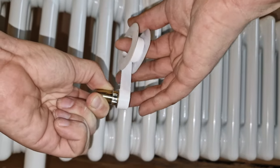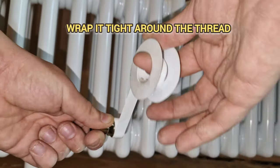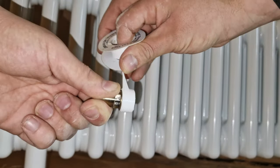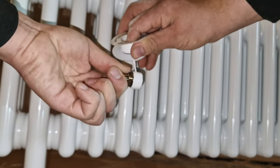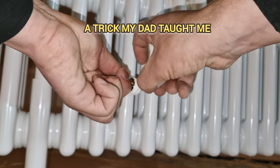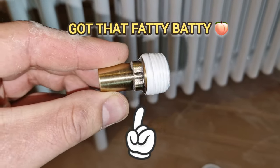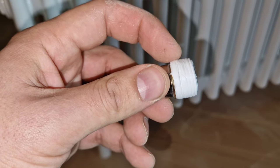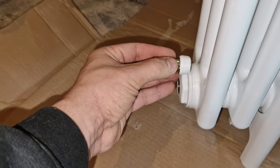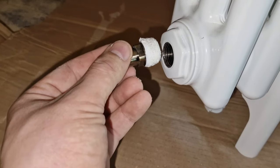What you're looking for is the visibility of the thread — you go along and wait until the thread is almost non-visible. Pull it quite tight, not loosely. Once the visibility starts going down, I twist around and form a bit of an o-ring at the end, building up a fatter section. As it screws in, that bunches up and forms a very tight seal — it works a bit like an o-ring. It doesn't have to be a lot because the PTFE does most of the job.